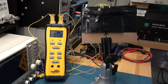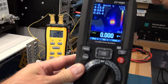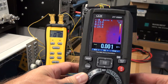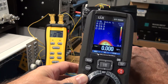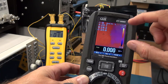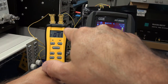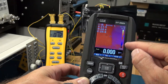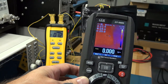This is a CEM thermal camera I've already reviewed — it's 80 by 80 resolution and has a lot more going for it. You can see the junction line on the CEM camera quite clearly. As I bring my finger in, it automatically changes the palette temperature range, which is why being able to lock your palette is quite a powerful feature. Without that interference, we can see we're up to about 1.1 to 1.2 degrees Celsius differential. I know this camera can see well below 1 degree C. Now let's see what the Perfect Prime can do.